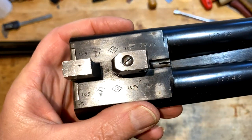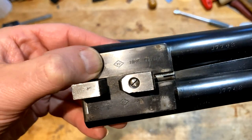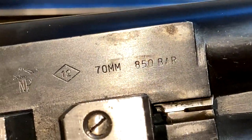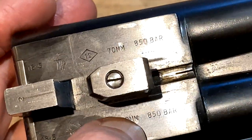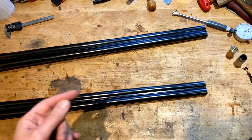I'll try and zoom this in here. You can see there's a pretty 18.5, which is the bore reading or cylinder. And I'll try and zoom in there. Oh, what a nice nitro proof, London nitro proof. And it says 850 bar, 70 millimeters, 12 bore. Beautifully done. And interestingly, the serial numbers matched on here to the other pair of barrels and the actions. Just to show I'm not cheating. On the other barrel, 18.5, nitro proofed, 12 bore, 70 millimeters, 850 bar. Zoom out. I'll refer to the charts